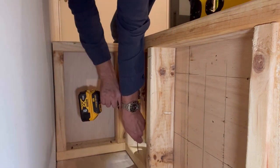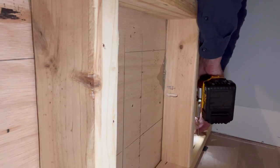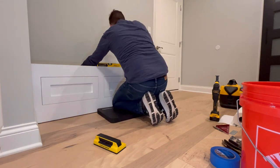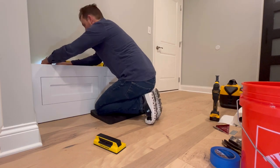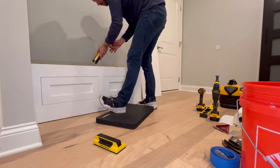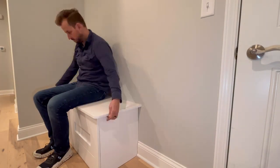My screws are only going to stick through about an inch so they go through the hardwood and into the subfloor without hitting anything below. I pre-mark and put my screws into the back wall stud ahead of time so that holding it up during install is a breeze. For the top, I use some more PL Premium, then sit on it and throw some nails in.